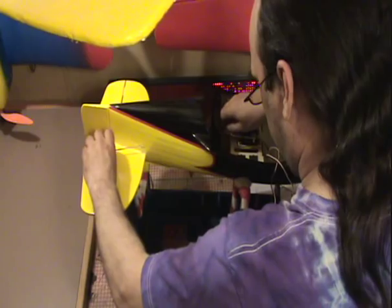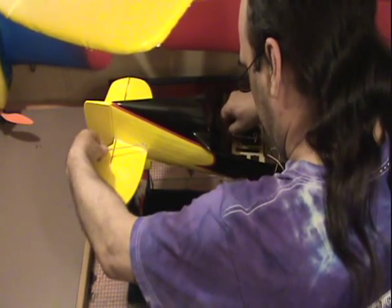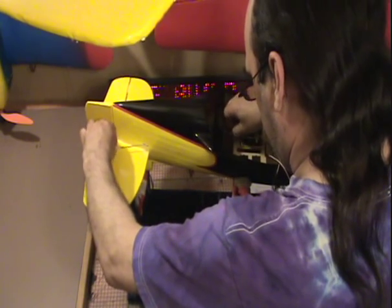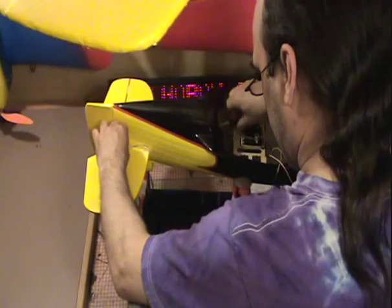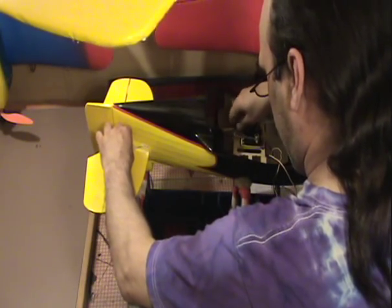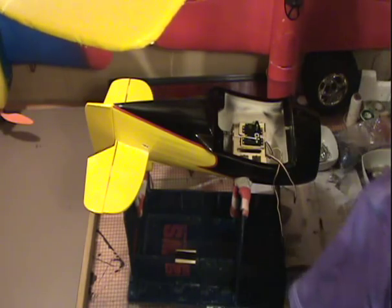So yeah, it's not going to work very good. I'm going to have to make that hole a little bit bigger to accommodate — I made it too high. Let my servo rod a little freer up this way. So, before I go any further, that's what I'm going to do. I'm going to take this off and take this rod back out. Then I'll get the Dremel over and make that hole bigger. And we'll be right back and put this thing together.